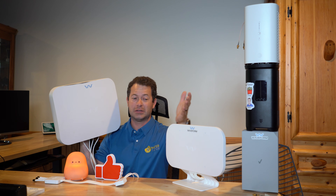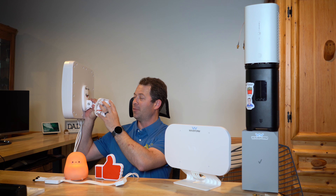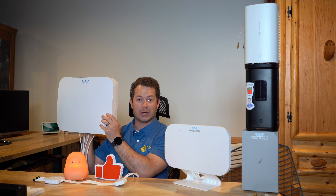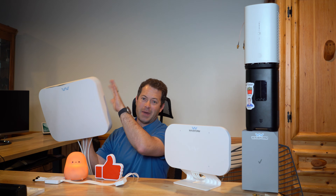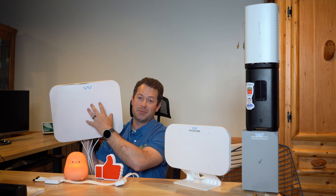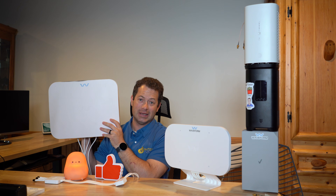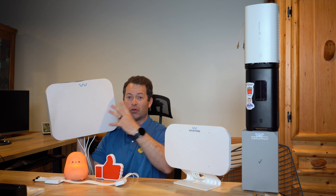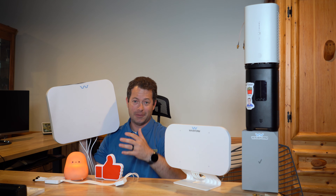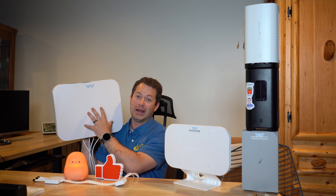Next up is the Quad Pro — a similar panel-style antenna. Both of these are 4x4 MIMO. The Quad Pro has their flex mount on it, so it's very adaptable — it can go on a pole or flat against a wall. Because it's directional — I call it semi-directional, since the front is directional but the back is not — pointing it at the tower will help your signal-to-noise ratio significantly. This is one of the best antennas I've tested. I use it at my house because I have trees and terrain in front of me and it's actually in my attic. This is probably my highest recommended antenna for most users.